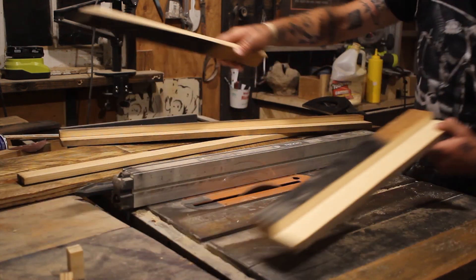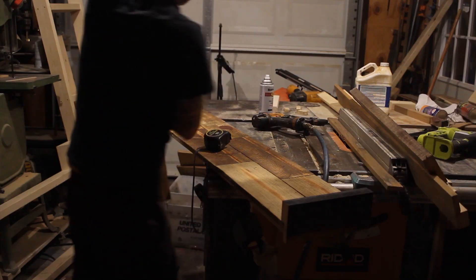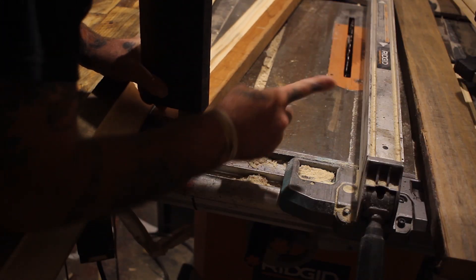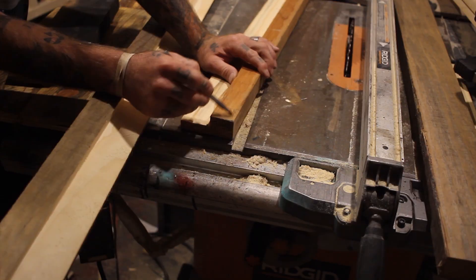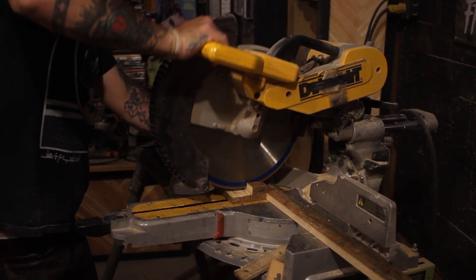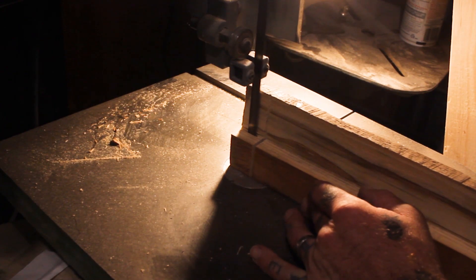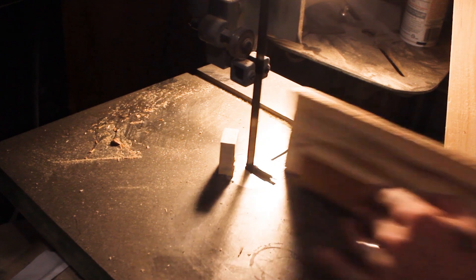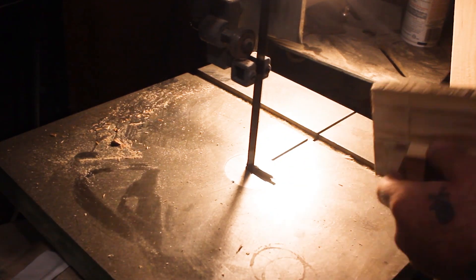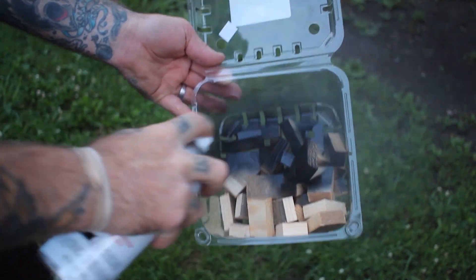Now with this one, because I didn't have enough wood to make the 45s, I had to remove this little notch — this little piece of wood right here — so I set a depth on my miter saw. Then I ran over to my band saw and cut off that little piece right there. This will make the frame meet up nice and smooth all the way around. Then I cut out all these little tiny pieces of wood and spray painted them black.